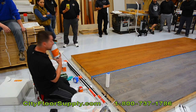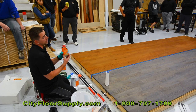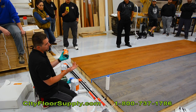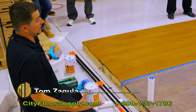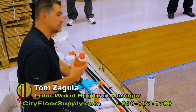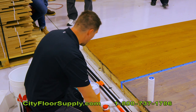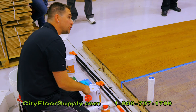There's a little A and 18 — match up the hardener cans. B, 18. They do have some slightly different colors on some of them, but all the labels look the same — it's company branding, it's the look that we have. Just read the numbers: 18 matches up with 18, it's a one-to-one ratio. On the mixing cup, there's a 10-to-one ratio for water-based and a five-to-one ratio for the oil.